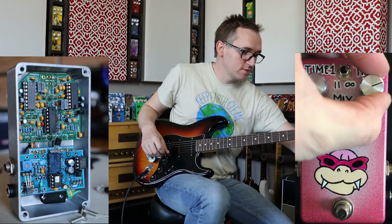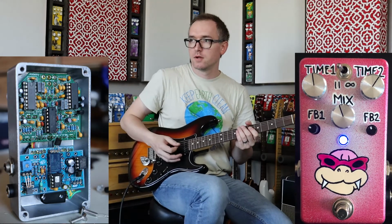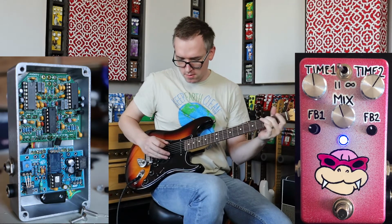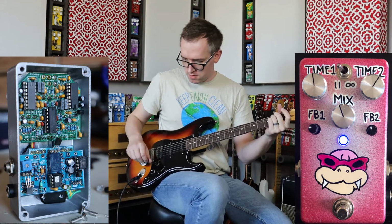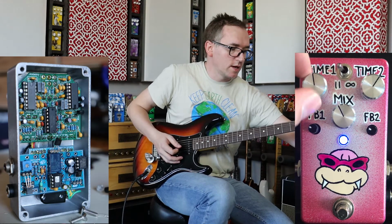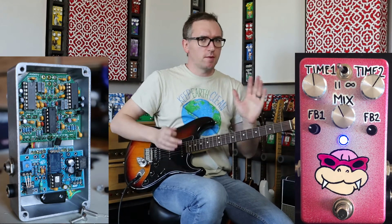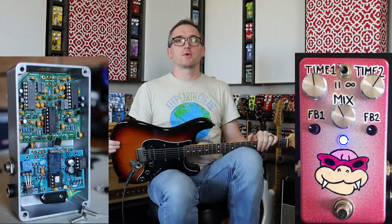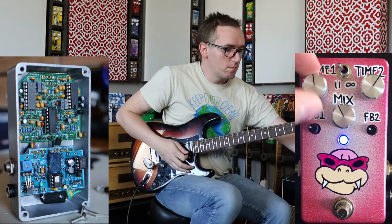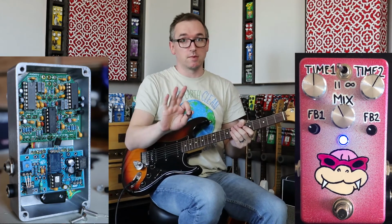Alright, so what I will show you here, earlier I talked about the Andy Timmons kind of thing. So for the Andy Timmons thing, I read somewhere that he sets his at like 300 milliseconds and 350 or something. So most PT2399 chips go up to about 600 milliseconds before they start getting really wonky and dirty. So my guess is we're somewhere around there. We'll keep the feedback kind of low, and we'll just kind of see how this goes. I'm not Andy Timmons by any means also.